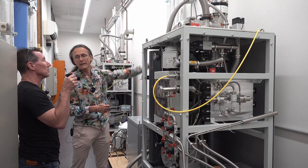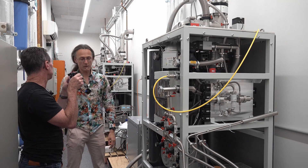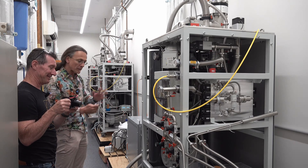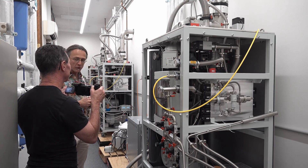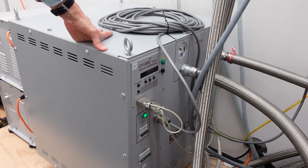Here are the tanks with the mixture of helium-3 and helium-4 — this is the actual gas that gets circulated, liquefied, and dumped into the fridge, then just the helium-3 circulates around. When we warm up the system and extract all the gas, it goes into these tanks. This is commercial — you can buy it from companies specializing in these things.